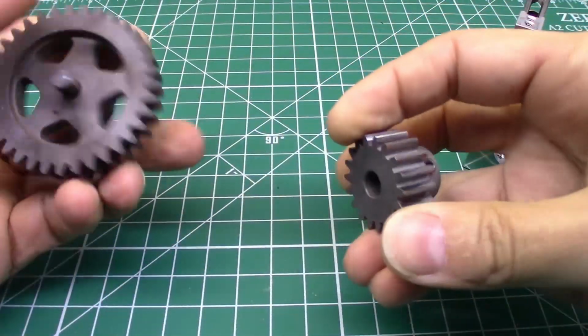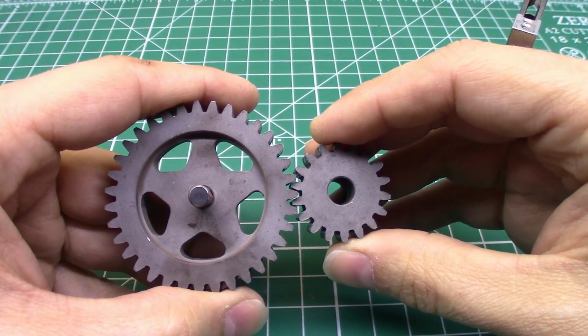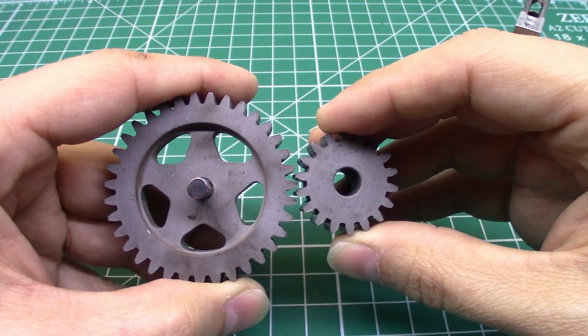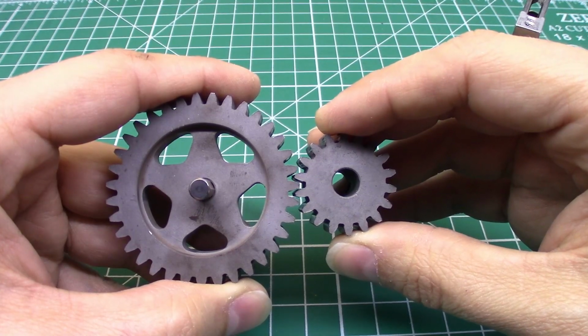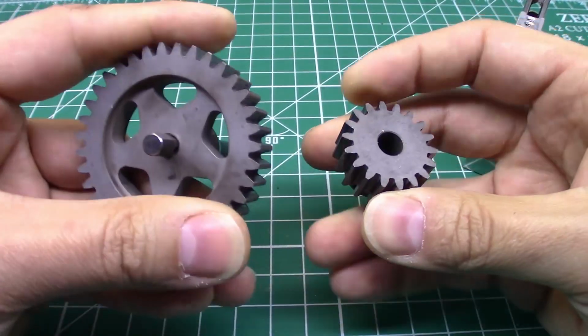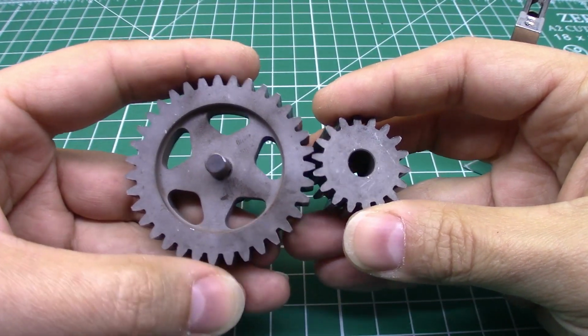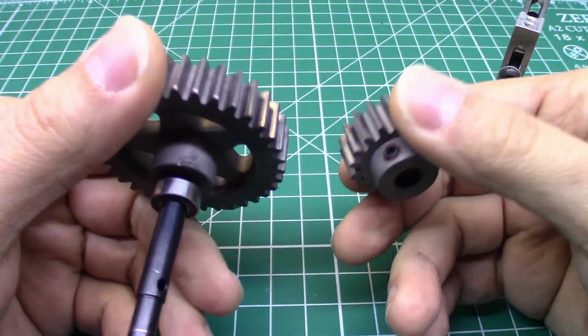One solution to this is, well, just run bigger gears. Bigger teeth means there is more room for those teeth to separate or move together without separating completely or smashing together completely. Also, these bigger teeth are stronger, so they're more forgiving to the teeth separating out. That doesn't really solve the problem, it just masks the problem.